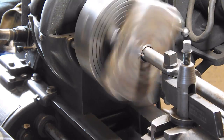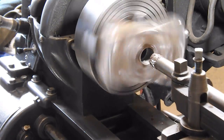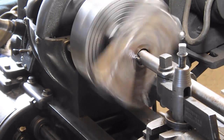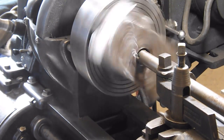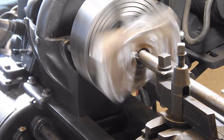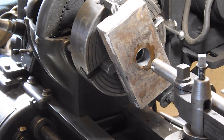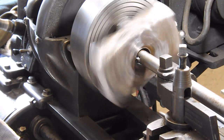The boring bar is slightly smaller than the drill bit — the jump is too much. The bit is actually sticking back through the boring bar and hitting the back side of the cut. I'm going to come over and try again, go as deep as I can until I work my way all the way through. I've got my feed rate at the slowest setting, which is four thousandths of an inch per revolution — so I'm just barely creeping in. Looking good. It's a little over an inch, so that's where I thought I should be. I'll take off another fifty thousandths.